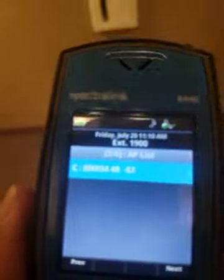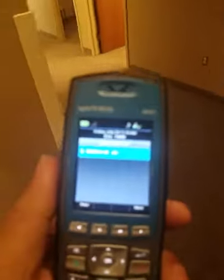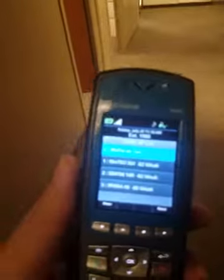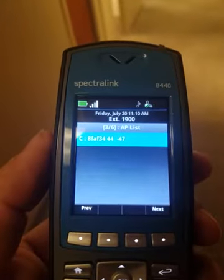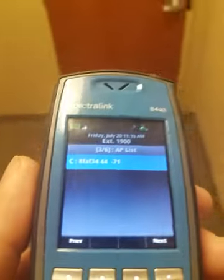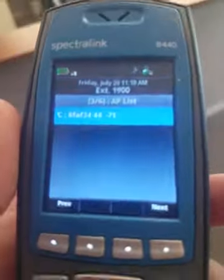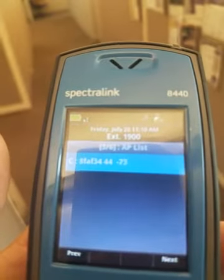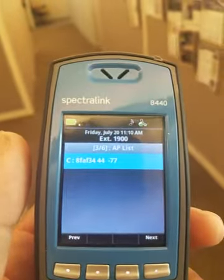There's an AP just in front of me. Neg 87. Oh, focus is not working. Neg 80s, neg 80s. There. Now neg 54. And there's the AP right there. We'll go through the door back into the office. Going kind of slow, neg 70s. There it scanned, and it did not pick a new AP. It's still at neg 70, 72.